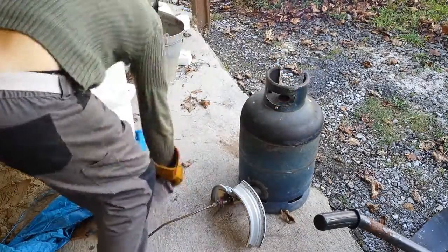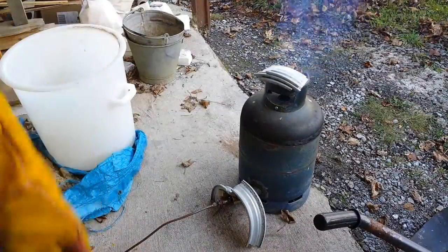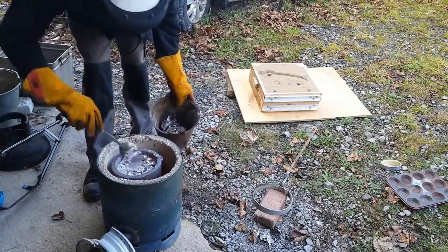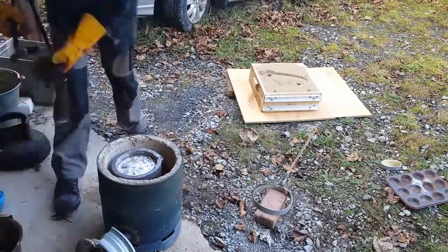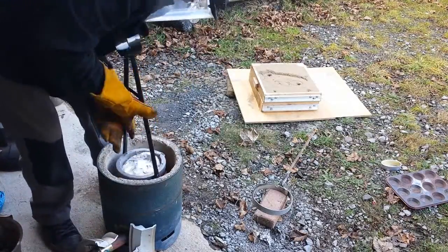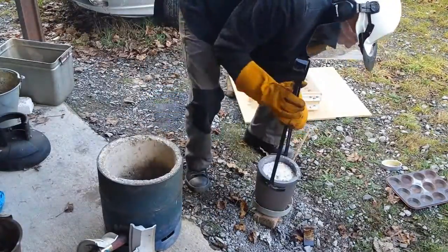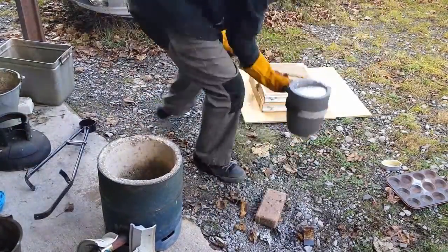So I'm just adding scrap. It's a good idea to preheat any bits you're about to add, and then after lots of that's done we can dedross and then use our crucible tools to get it out. In this case the upstand sort of got stuck to the bottom of the crucible, which is a bit annoying, but it's okay.